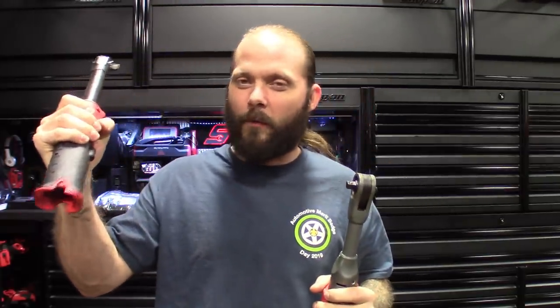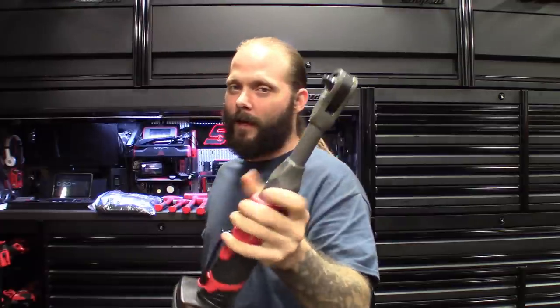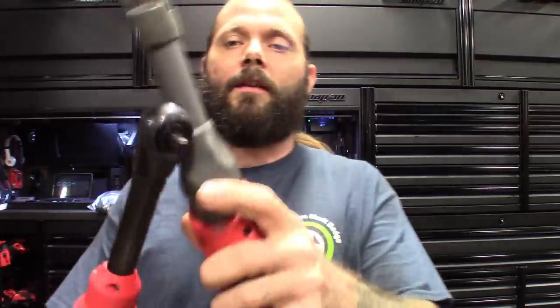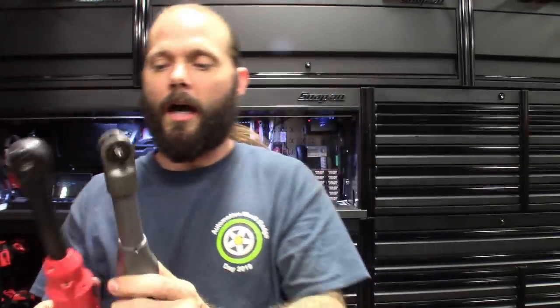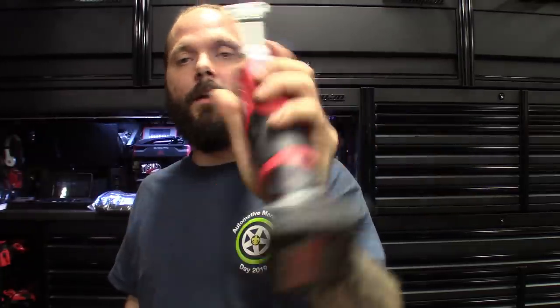Neck to where the anvil starts, the length on them — the Snap-on one I do notice is definitely more powerful than the Milwaukee. I can't remember the exact torque; I want to say maybe 45 or 50. The box on the Milwaukee three-eighths, I believe, said 55 — got the box in the back office. Leave it down in the comments and quote me if I'm wrong. Part number on the three-eighths is 2560-20 for the bare tool. Comparing it to the quarter inch long neck — about the same height with the battery on. I still got the rubber coating on this one; I use it a lot less than the three-eighths Snap-on. Same reach, and I think it's the same torque too — got the gauge on there.